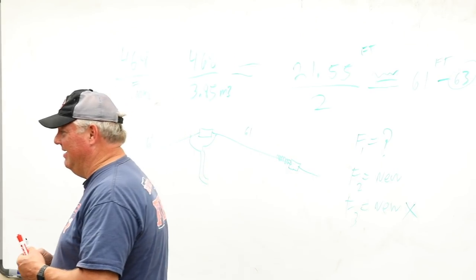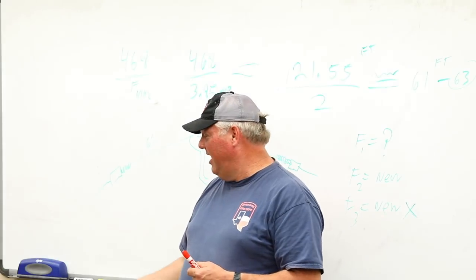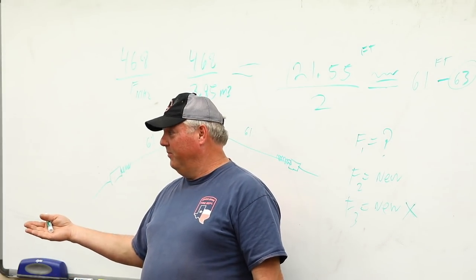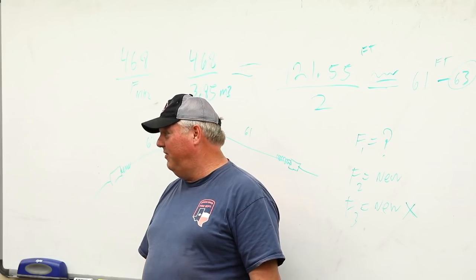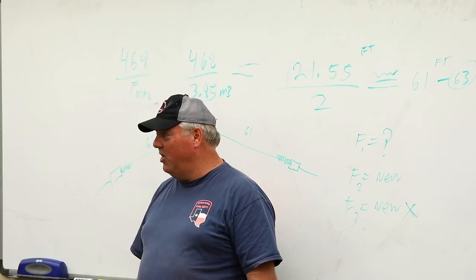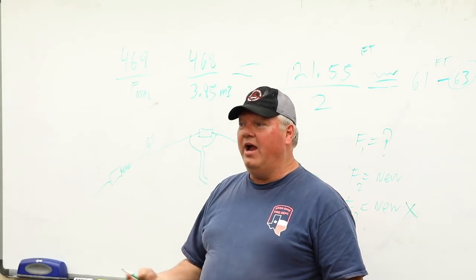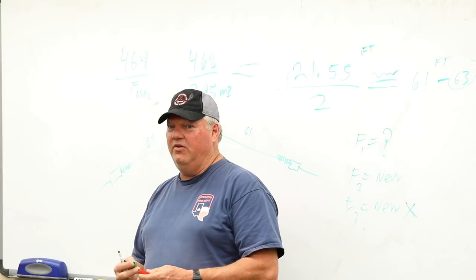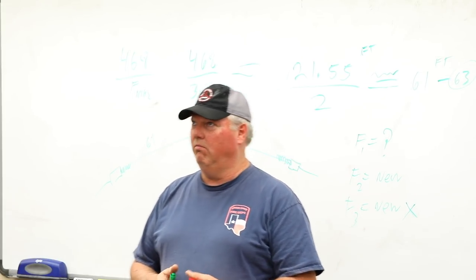Well, what'd you test it with first? I just stuck the radio on, looked at it, and it was 50 ohms. Oh, you didn't put a meter. But even if I put that on there, it would have read 50 ohms because it was 50 ohms. I put a resistor on there. It tricked me because I was dumb. So the makeup of that wire is super resistant. So that was a perfect example of just because you have a great match, does it mean you have a great antenna? No.